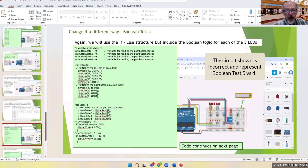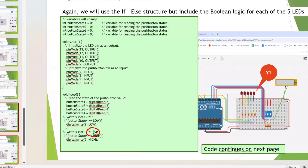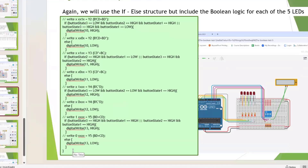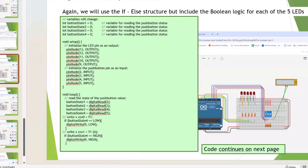The resulting code is greatly reduced versus 155 lines. In the void loop, Y1 through Y5 represent the five output digits. Y1 is the least significant digit, so it's simply the A output — buttonState4 directly drives that LED. Y5 is the most significant digit. You define the Boolean expressions and then implement them.